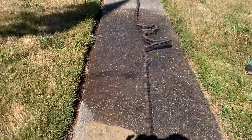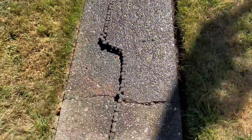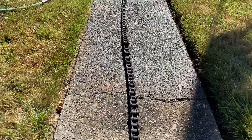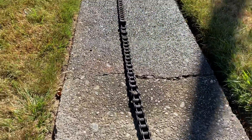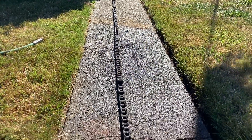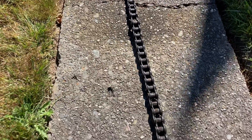You see it's quite loose, bent and whatnot. Probably one more time in the tank. I can still see when I pulled it out there's probably about five percent of it still got surface rust on it, so that's probably why there's still some jammed-up links. I'm gonna coil it up and tie it, but I'm not gonna put it back in the tank. I've got another mission to go on, and I like to be at the house when I'm doing the electrolysis process — if there were a crisis, I'm here to shut it down.